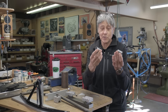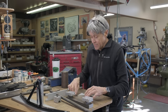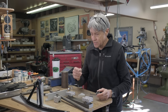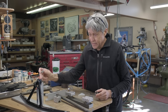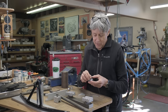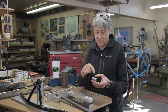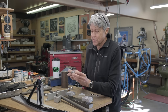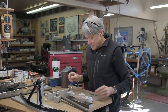I made the clamp tubes. It's 4130 chrome moly. I made the pinch lugs, and I was thinking about making the bars and then tacking this on later. I think what I want to do is to tack it on first, because I can just use a vise over at the TIG station, one tack on each side, and then I position this on the fixture. That's an easier way of doing it.